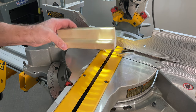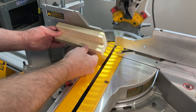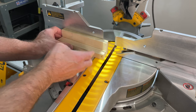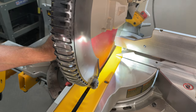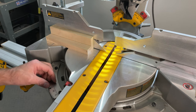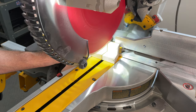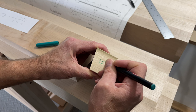I've got a piece I've used for making various dovetail jigs over the past few years — it's cut for a one to six ratio right now, so we'll just nick off a tiny bit to make it the one to eight. Then we'll set the saw up about seven and a quarter to seven and a half degrees the other way and nip off the other one. There we go — perfect dovetail jig.